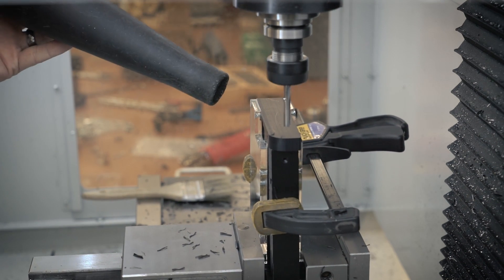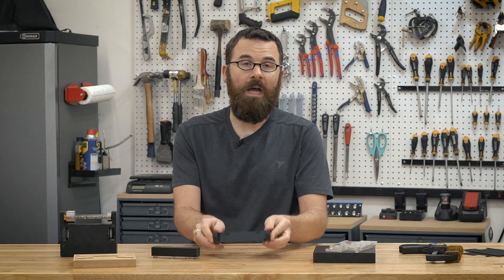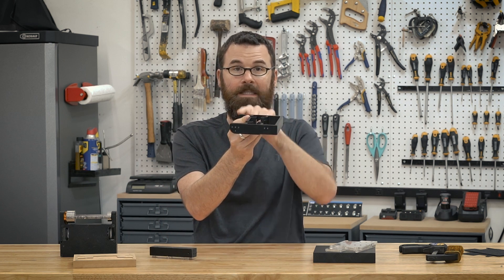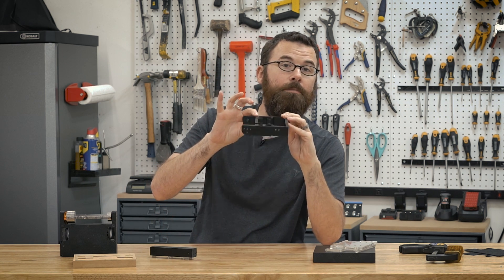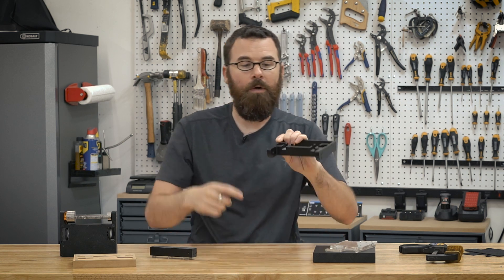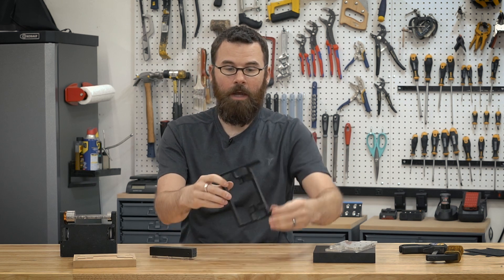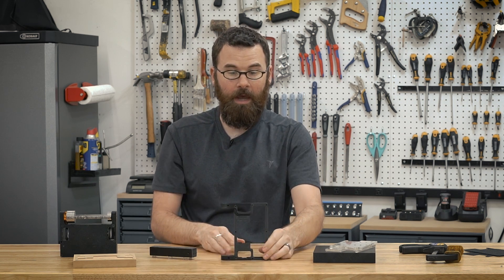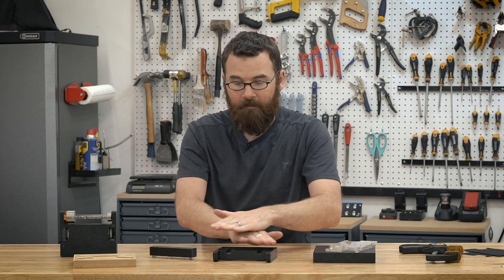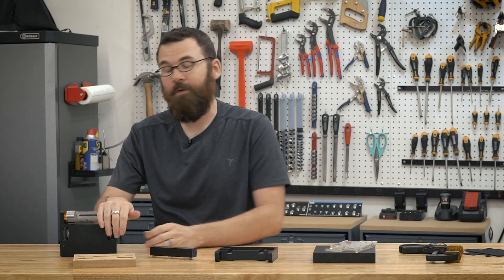The last thing I want to mention is indicating the part. If I indicate off the top on both sides it guarantees that my shafts are aligned at the exact same distance down. This is nominally a one-inch piece of UHMW but it's not exactly one inch, so I always indicate off the same face — for instance, indicating there, then when I flip it over indicating off this side — so that these two holes will line up and I get free-spinning motion.